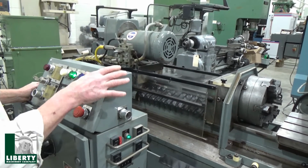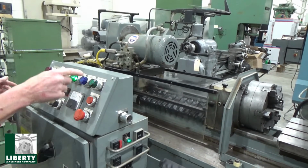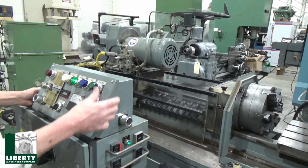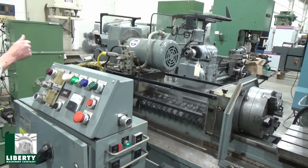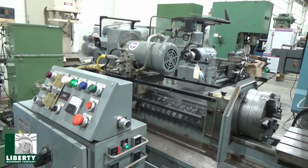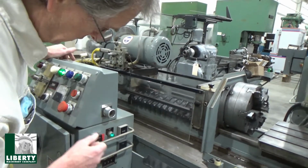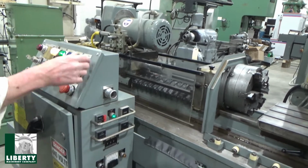So, head retracted. Let me see if I've got a cycle start right now. I should, but I should have spindle lube normal. I've got that. And reset, and that might be it there. I hit spindle lube. That's the main air supply. Hang on one second. That's all good. And I don't know if I changed something or not. I shouldn't have to reset. Spindle lube normal, head retracted, full depth. Oh, I know what I'm missing. We need auto cycle over here. Yeah, that might help. Let's see if we got it now. I forgot. That's still the standard Eldorado package here.